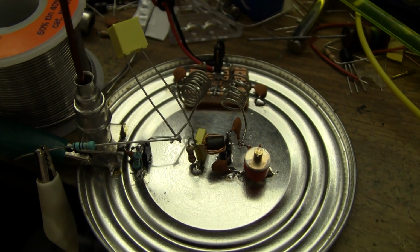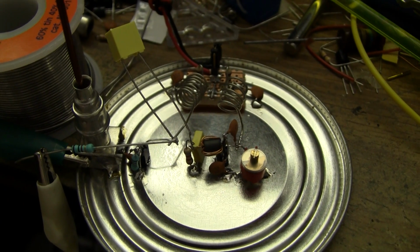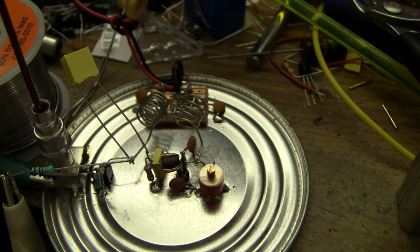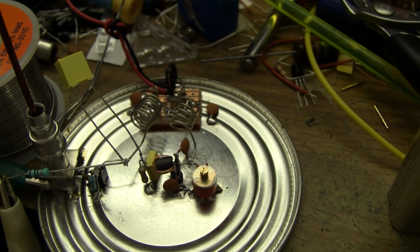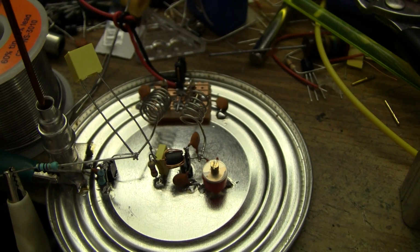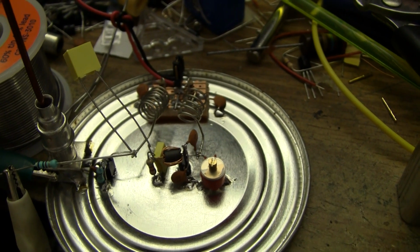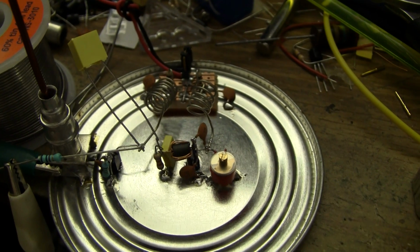Might talk about that briefly in a video too, about how to actually bias FETs. Biasing FETs and biasing BJTs is something I should probably cover, maybe not in the Advent series, but anyway, because it's interesting and everyone should know how to do it. It's not difficult, and it takes the mystery out of those values that you see in projects all over the place. You wonder why they pick the particular resistor values they do to set up transistors. There's nothing magical about it. A little bit of math and some rules of thumb, and you're 90% of the way there, and the rest you can do either with simulators, if you want to worry about the temperature stability of a circuit, or you can just build the practical circuit and test the heck out of it, which is probably what most people actually do.